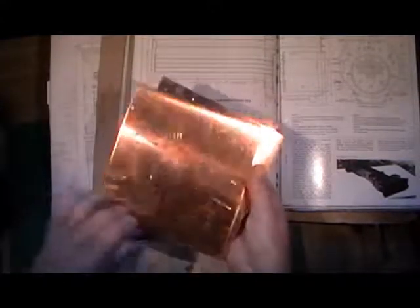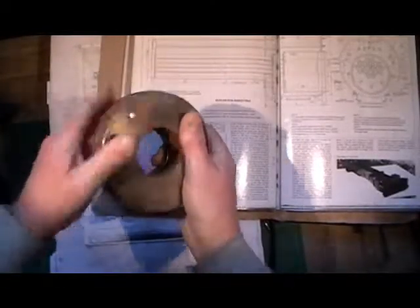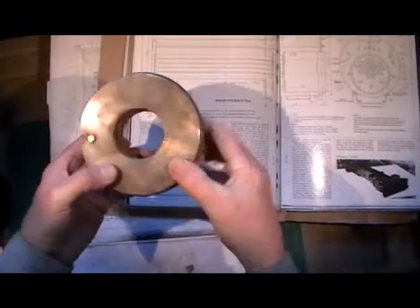Right, so where I'm up to at the moment then with this, I've got my plates ready to mark out and just to cut into the appropriate diameter. But what I'm on with now is I'm just on my milling machine. I've made the blank to do the outer flange and put the locating pegs in. I'm just making now the other plate to go on the top to clamp these plates together. So there'll be another plate on top to clamp them together so I can form my flange.